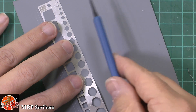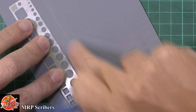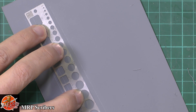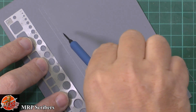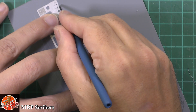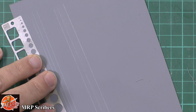Now we're just going to switch over to the blue one and see what happens. Got a little bit of tearing - you can probably hear it - and that's not exactly nice, it's sort of ripped all the way through. We're going to try it again. Changing the angle, coming up from a higher angle now, and that is definitely better. It doesn't like being at a low angle, it likes to be at a higher angle. So at around 45 degrees there's a lot more cutting power and that's actually taken out a very nice channel.